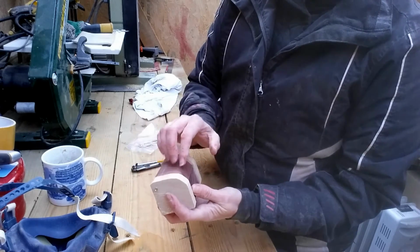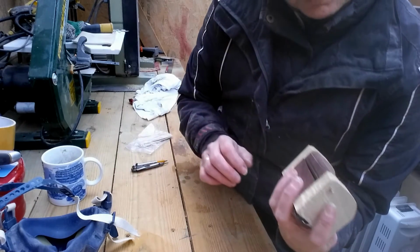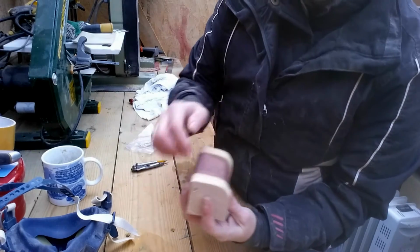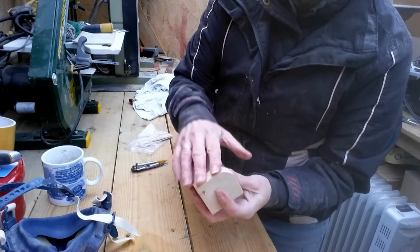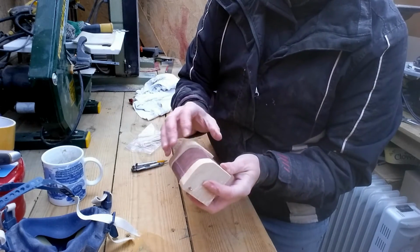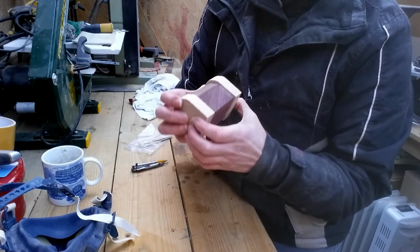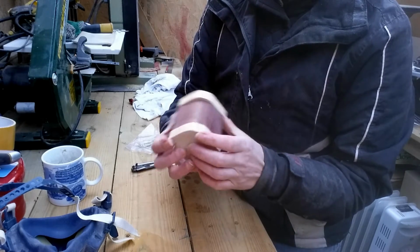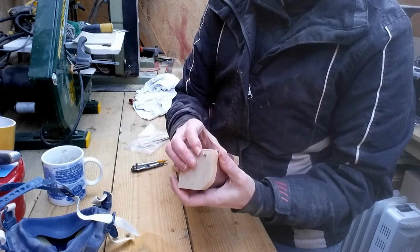That'll be what it's like. There'll be a little bit of a lip there so that you can stick your nail under it to open it up. But I mean, already you see it's not quite tight up at the back there, but already, you know, it's pretty good fit. Once I sand these bits off, I'll go away and sand the two sides, and then I'll come back and show you a bit more about how it's fitting and about the gluing up, because this will be glued up with the wood slightly over, and then it will be all sanded with all of this shut so that I get a really nice tight fit and that it all is smooth at the end. That's basically what I'm looking for.